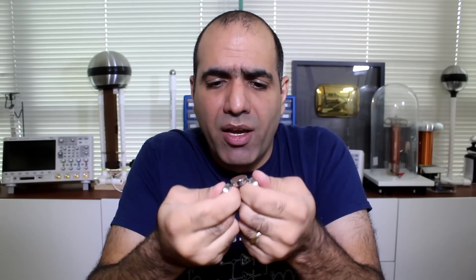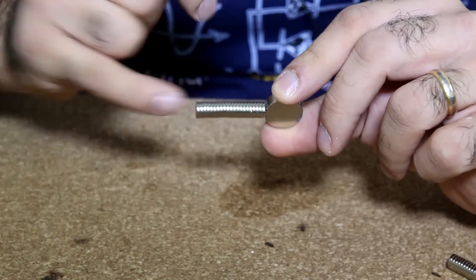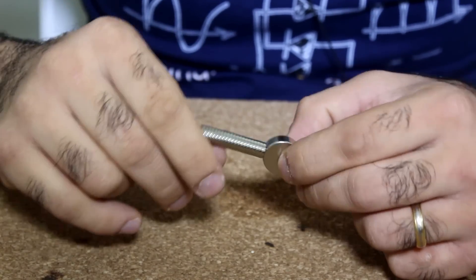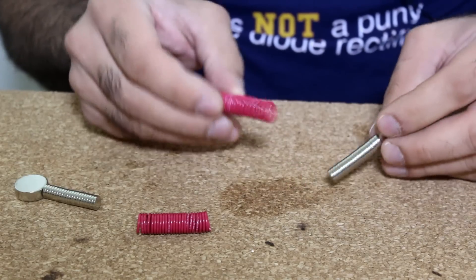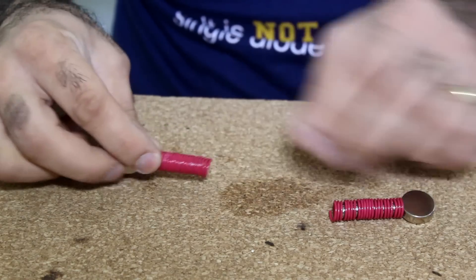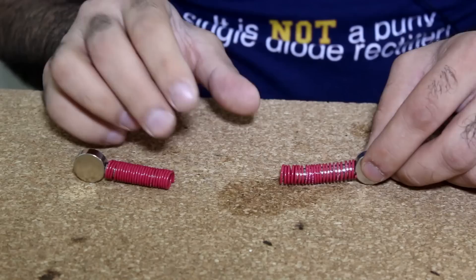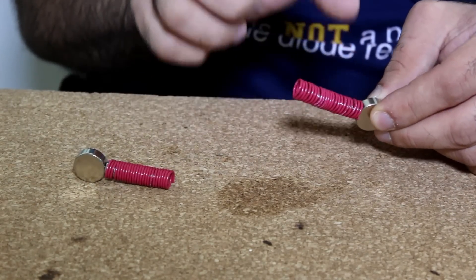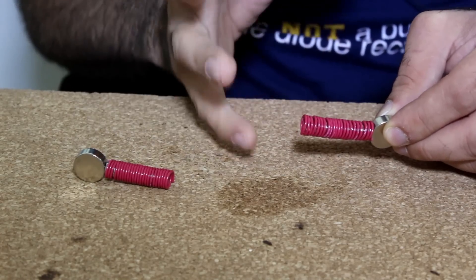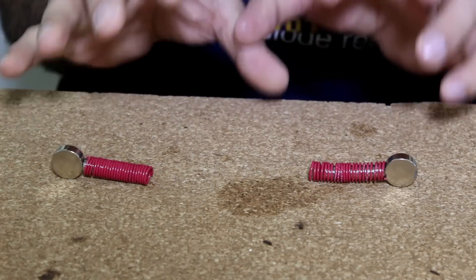I don't have the exact same magnets, but I think I can do better. I have two bigger magnets connected to a series of smaller magnets, so the field of the big magnet is focused through the rod magnet. The tiny magnets have alternating magnetic fields north-south, north-south. Now I'm going to slide some coil on top of the rod magnet. As we know, a magnetic field passing through a coil creates electricity, especially here where I have alternating magnetic fields amplified by the field coming from the big magnet. The large alternating fields create large AC energy across the coil, and so the unloaded voltage across the coil just rises significantly. With my setup, one of these would be enough, but two would make a more uniform electric field at the center.